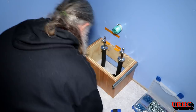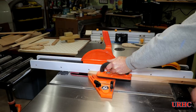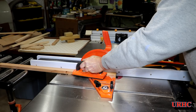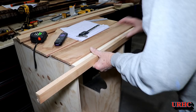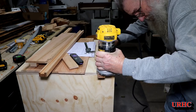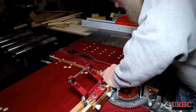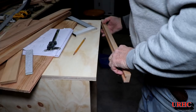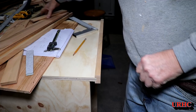That's the pedestal installed — now it's time to go back down to the shop and work on finishing up the cabinet. I need some corner pieces to face off the plywood. I went with cherry strips, cutting some strips and cutting some grooves to line up with the edge of the tongue-and-groove. The one on the side needed a matching 45-degree chamfer to the V-groove on the tongue-and-groove paneling going on the side. Once everything was ready, it was just a matter of cutting it to the length of the plywood — you can see it locks on nice and tight.